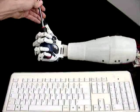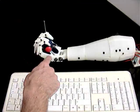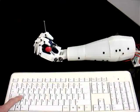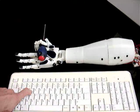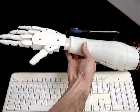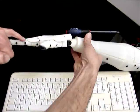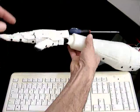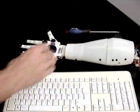I'm not saying that it's so strong, but it's all right. What is nice with the system — with the double cables on the servos — is that fingers are not wobbling. Once they are fixed, actually with the cables, you can see that if you put the hand flat like this, it's not wobbling like other hands have been doing with the spring system. This is firm enough.